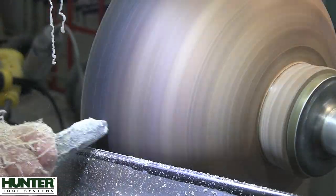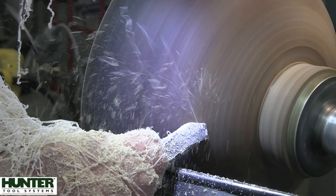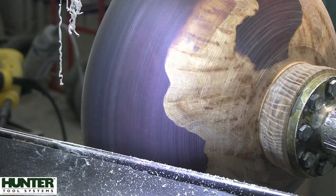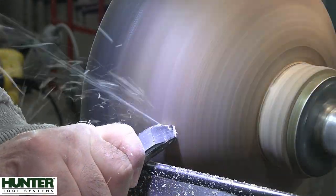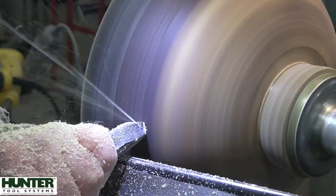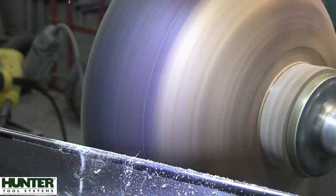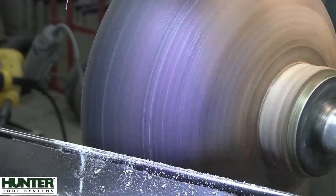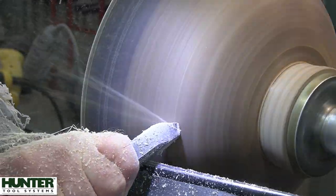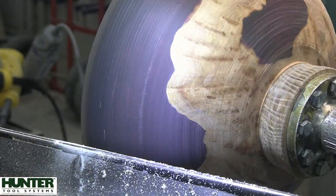As you can see we had a little ways to go yet. When I put that burl into the bowl the upper part wasn't touching the inside of the bowl, so that's why it's tilted in just a little bit there at the top. Just whittling it down - in the previous clip I've got the tool handle down and the shaft of the tool at 45 degrees on the tool rest, with just light sweeping cuts back and forth. That will give you a really good surface going into sanding.